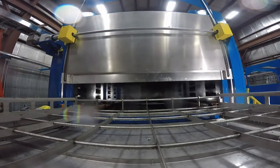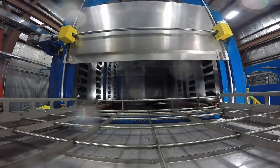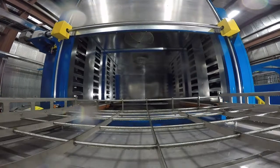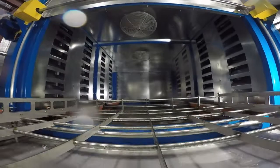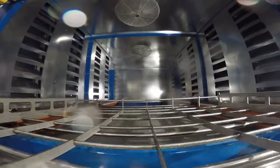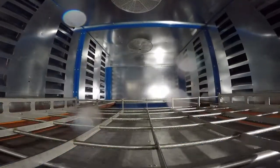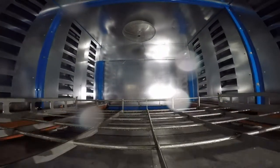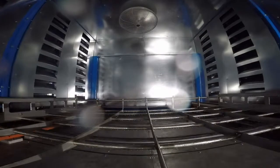Dryer Station. This station can be powered by electricity, gas, or steam. REL puts the coil in the duct that is circulating the air in the station. Temperature control in the oven chamber is accomplished by the temperature in this duct. REL ovens come with a customer-specified calibration port for oven temperature verification.